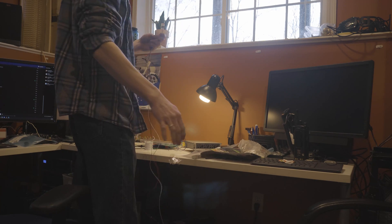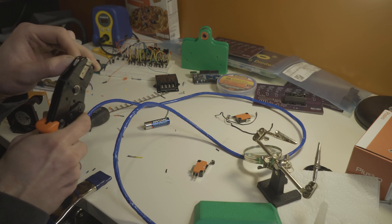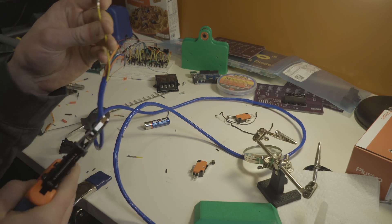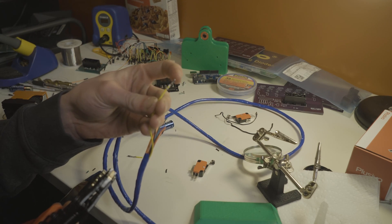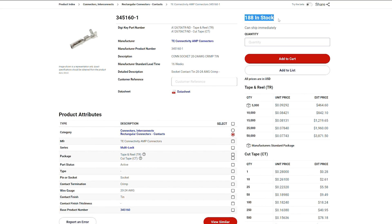Let me know in the comments what projects you've had go the same way. When I made the gear indicator, I got to use the pin crimper for the first time. I wasted several pins before I found out it's a directional tool — I was using it the wrong direction, which caused it to be way too tight and basically severed the wire going into the pin. These pins are really expensive, almost a dollar a piece, so if they were cheaper I wouldn't be bothered at all.